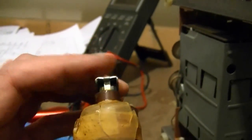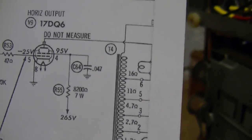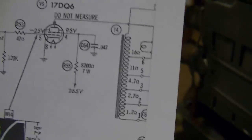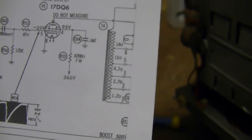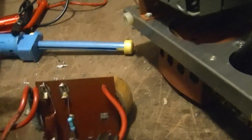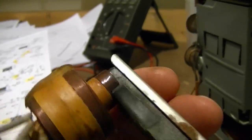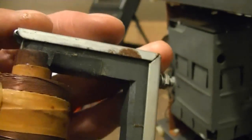Oh, that's right. This doesn't have a primary and a secondary. It's just all one coil with some taps. So that could account for it. So they must have more current than they typically would when there's a separate primary and secondary. So that's good, because it means I don't have to worry too much about accidentally brushing against it and snapping a really fine wire.